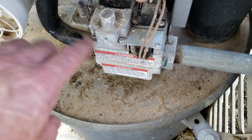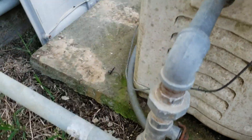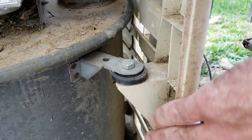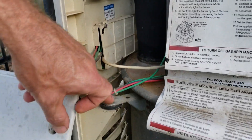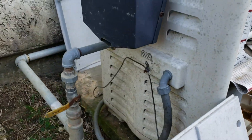Come over here — since this gas pipe is connected all the way through, I need to lift this whole lid and I don't want to take off any of this mess. I'm gonna have to unscrew it and there's a coupling on this side. So gas valve turn off, loosen this, and this will come right out. Because this entire wall is gonna need to come with it, I'm going to need to also loosen this screw here that holds the bottom of the tub so I can move this plastic out of the way. Those can stay because the tub is staying, but these have to move just because of the side panel. That should be everything — it should all come up in one shot.